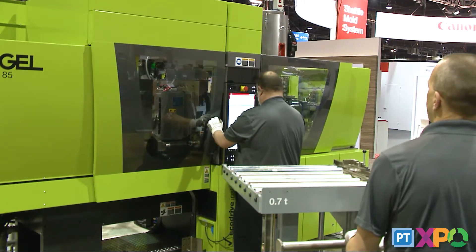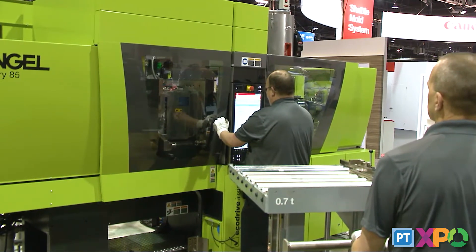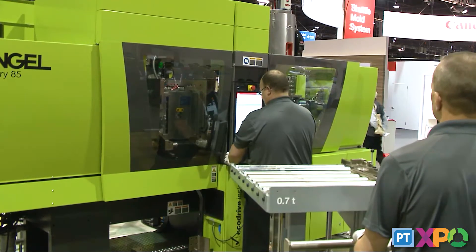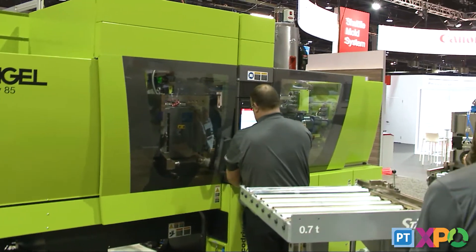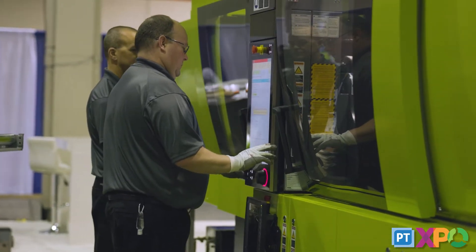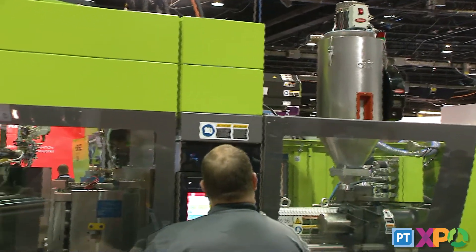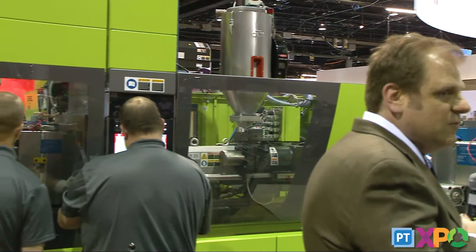The tools also have a feature — an RFID connector mounted on the side of the mold. This holds all the parameters so we know which mold is running next. It uncouples from the tool and is placed into a socket in the back of the machine; the machine won't run unless it's placed in that socket, so it always knows what mold is installed and can set the parameters accordingly. The RFID unit is kept in a solid, secure box that can withstand some abuse as it goes around the shop floor.